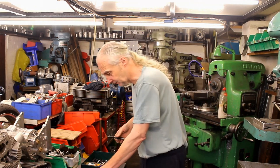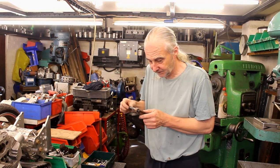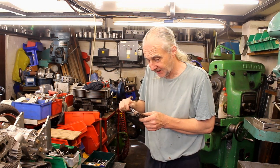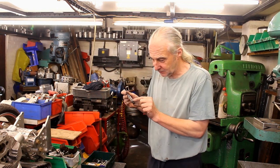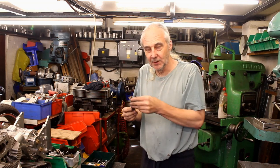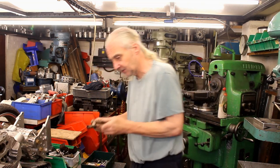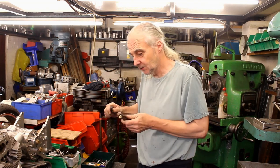That will take the bushes in there. You've got your adjusters on there and you just have to use them very gently, and just keep going through. The only thing is with a conrod, it's quite easy, as long as I've got my jig made up. You've got to make sure it's absolutely parallel to it.